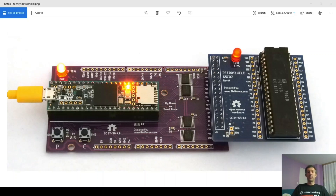Arduino is cheap and simple, but it has two limitations. First, RAM is limited to 8KB only. Second, speed. For simple bus transactions like 6502 and 6809, we can get up to 200KHz. However, for processors that take more than one cycle per instruction or have complicated bus transactions, speed is only acceptable to learn the instruction set.